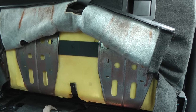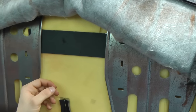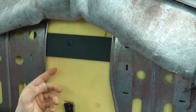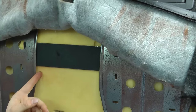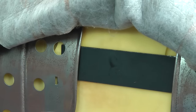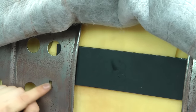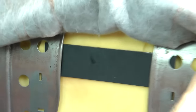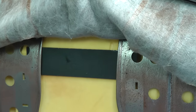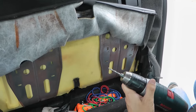What we went ahead and did is put a one-eighth-inch flat bar behind the plate. What we're going to do now is go ahead and mark the holes for installing the flat bar. The first hole we're going to mark will start on the left side. We're going to do four bolts, so we're going to mark a top hole and a bottom hole. Now we're going to do the same thing on the right side. Now that we have our holes marked, we're going to drill those four holes, starting with a one-eighth-inch drill bit or smaller.